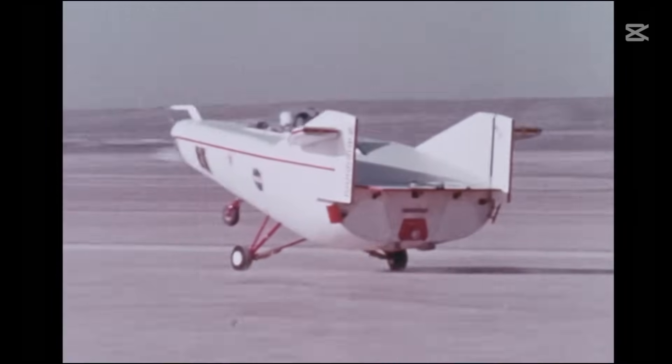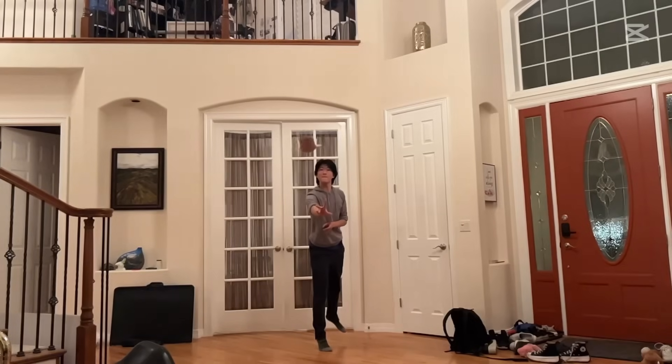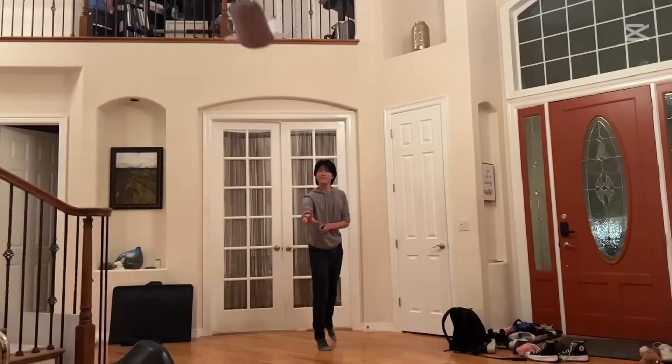The fact that this plane is super light kind of helps with that. But in real life, these lifting bodies need a super high angle of attack to actually achieve lift — if they're kind of flat, they're not going to fly well at all unless going super fast. So I don't think this is a true lifting body, and I want to fix that.